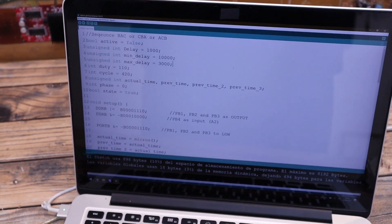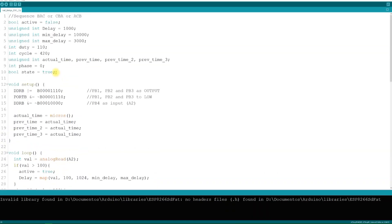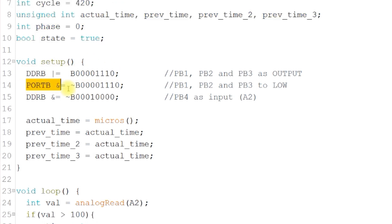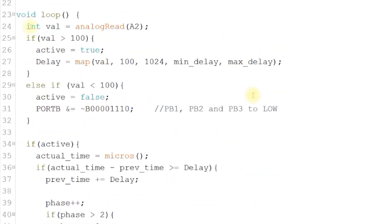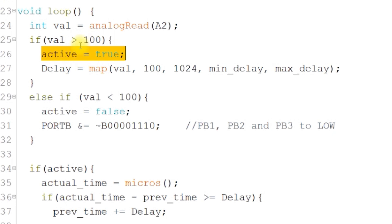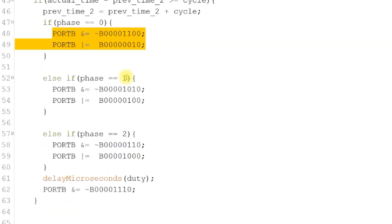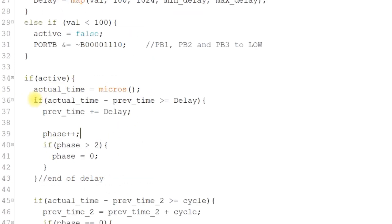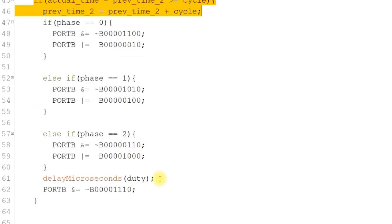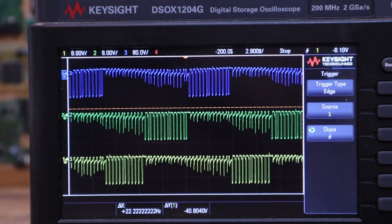Let's take a quick look at the code. First I define all the variables. Then I set the MOSFET control pins as outputs and set them low at the beginning with registers. In the void loop, I read the voltage from the potentiometer and if it's over a certain threshold, the rotating sequence activates. Since this is open-loop with no feedback, all we do is switch one phase high at a time with a small delay using a while statement. Another while loop chops the pulses into smaller pulses to also control the power. I'll try to post a different code below that uses PWM input to control speed with interruptions to read the PWM signal.